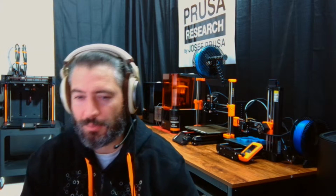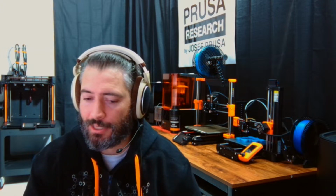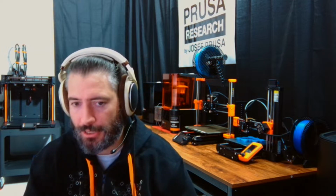It's very easy to say, oh, this roll of filament's $18 on Amazon, I'm just going to buy it and save some money. But I started my little journey to getting to the right plastic by buying everything under the sun I could find on Amazon. All the cheap stuff, some of the expensive stuff. I was just curious. And what I found out, and the reason I wanted to make the point earlier, is that even though they have the same name, PLA or PETG, the same plastic from different vendors behaves differently. I was having to change my print settings: one PLA would print perfectly fine and then two other vendors would print with stringing. So I'd have to lower the temperature to get those to print fine, but then the other one would under-extrude a little bit, or be a little brittle. And that's where now, if you find a filament manufacturer that you like, you can use whatever settings you want, or find some good settings and dial it in.